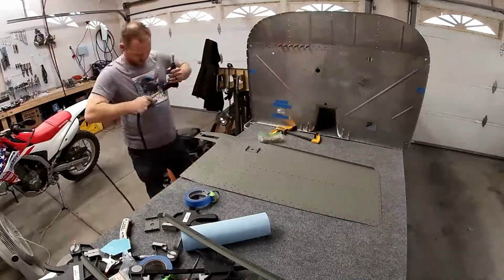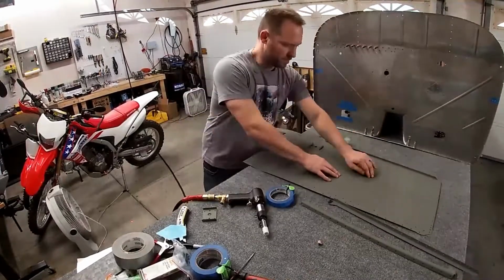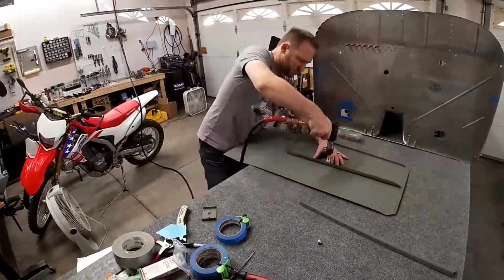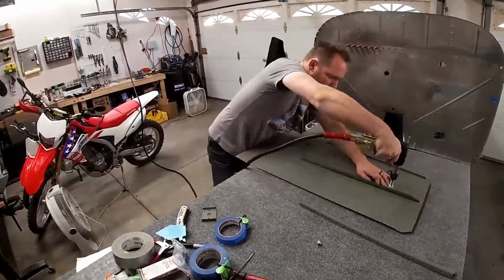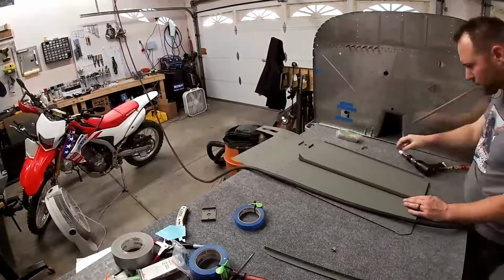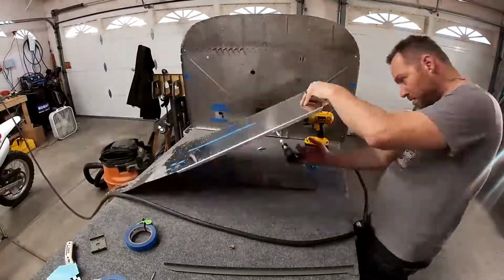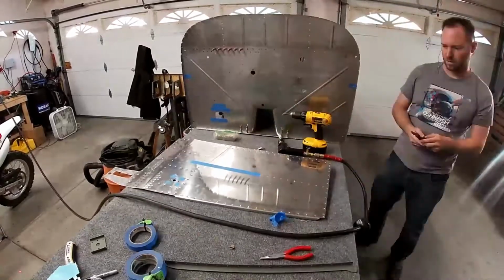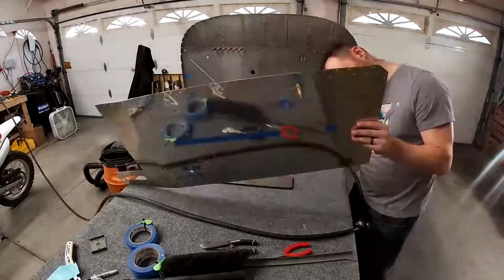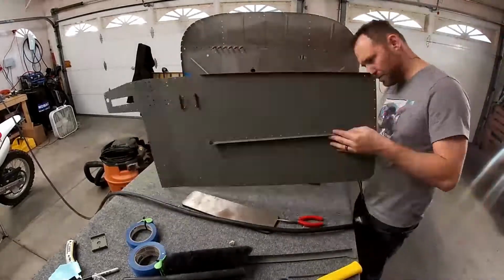So I decided I was going to back rivet it on, and I only messed up 3 or 4 of the rivets. So that's always fun to drill out rivets. Pretty sure I accidentally oversized one, and I used my first oops rivet, which is impressive because I don't know how I have not used an oops rivet until now. But basically what an oops rivet is, it's an upsized rivet with the same original size head. So these rivets here are, oh yeah, and you're seeing me right now accidentally oversize this.